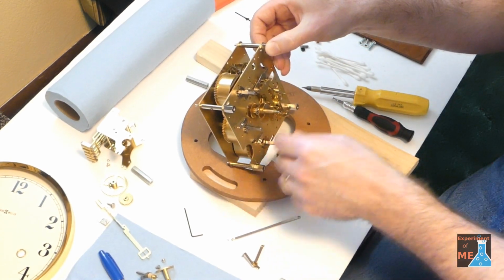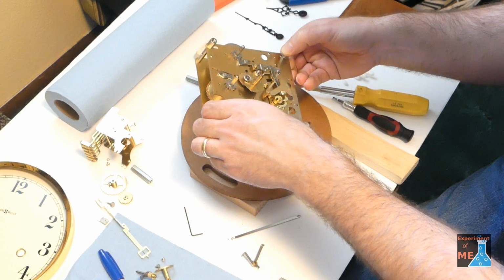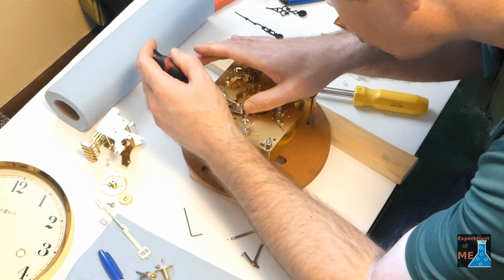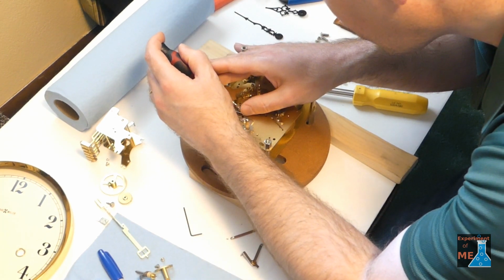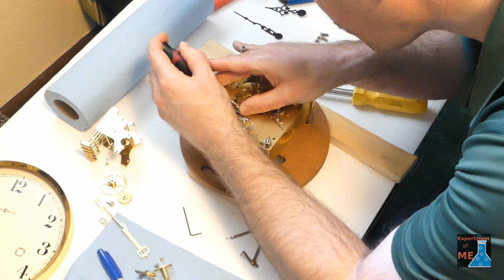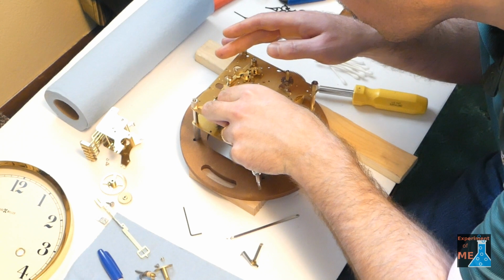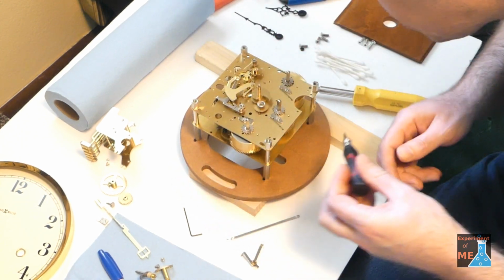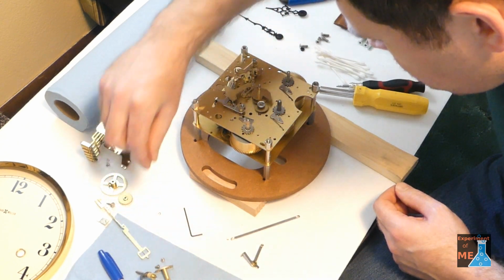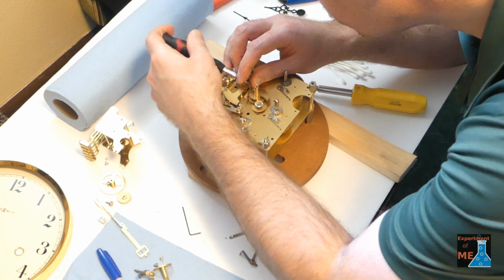And there's the nut I need to take off on the front side. And it turns out that there are some chiming mechanisms in the way, and so they have to be removed first. And they are also held on with snap rings, smaller ones from the spring rod snap rings. And they kind of stack up in such a way that they have to be taken off in a certain order. And they also have to be put back on in a certain order.